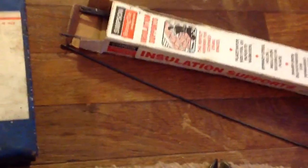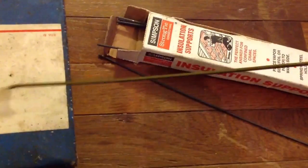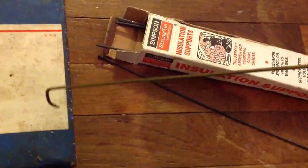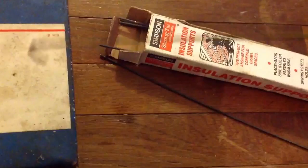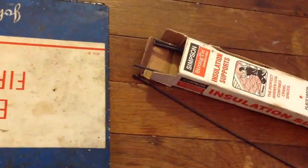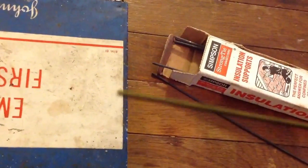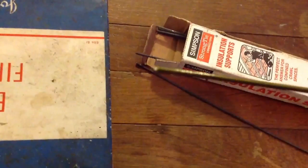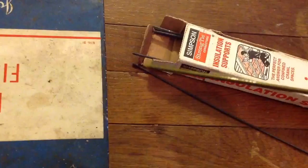You can actually make a longer bit with your coat hanger — just put a cut in it like this, and you can actually bend that into a straight piece. Make a real long drill bit if you're looking to probe through a lot of stuff. You can actually go two feet if you need. They're not very common, but you go nice and slow with it and that tip will go through wood — it does a pretty good job.